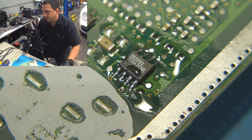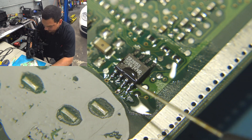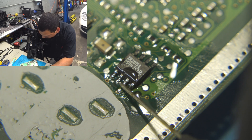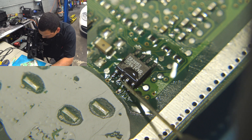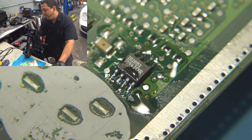You're going to want to use your back probe or needle and check your work. I personally like to nudge the pins — not too hard though, you don't want to rip the pad off.